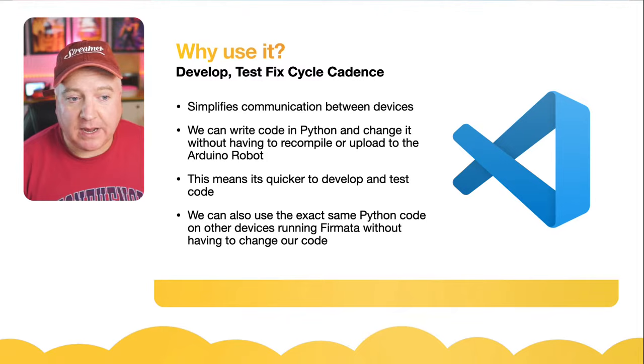So the exact opposite of that, where I've done write one, write one, one and zero, it's write one, zero and one. So the opposite direction makes the robot go backwards. Then turn left is both ones for the motor speed, and turn right is both zero for the motor speed. And stop just sets all them pins to zero. Now just in case that hadn't worked, I'm going to make the robot go forward, stop, go backwards, left, and then right.